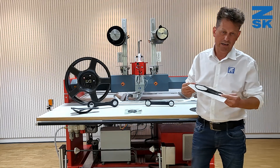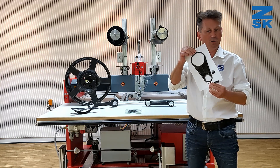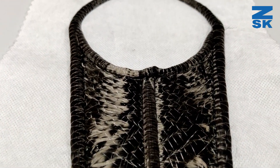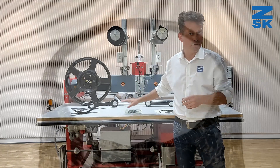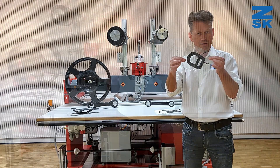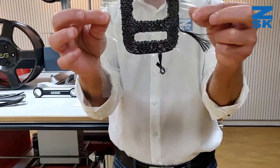We place any kind of fiber on a carrier material. In this case the carrier material is a non-woven polyester — this could also be a glass fiber material, or in this case we even have a thermoplast which will be melted in the mold as well.